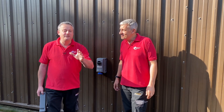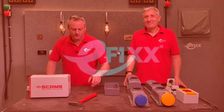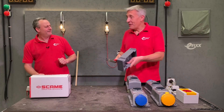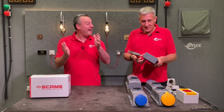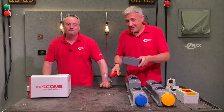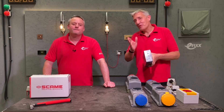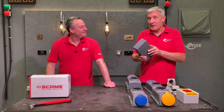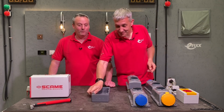This Scame socket has a feature that makes an electrician's life easier, so stay on to see what that is. That's what I mean by tough when it comes to GRP. It can withstand a hammer blow — it's actually got an IK rating. What's the IK rating? IK10, which if you want to get really technical is equivalent to dropping a five kilogram weight from 40 centimetres above the product, normally onto the sensitive areas like the switch. So it's probably way above that — that is a thick bit of plastic.